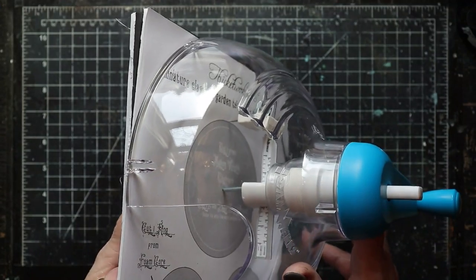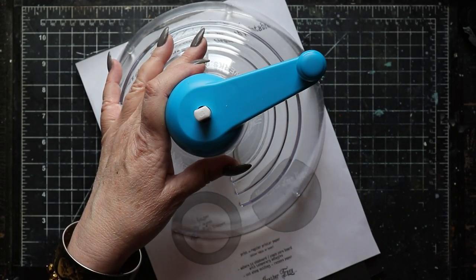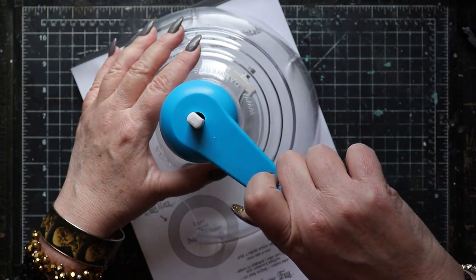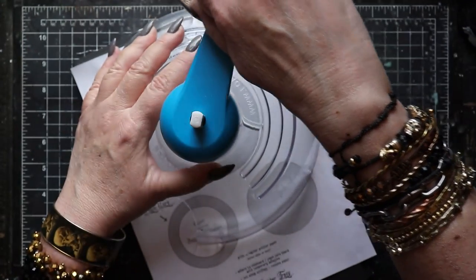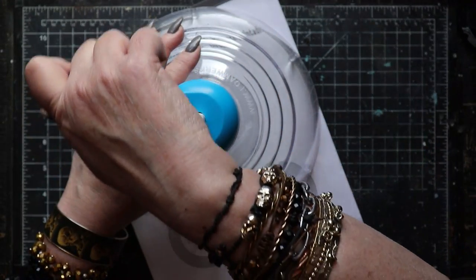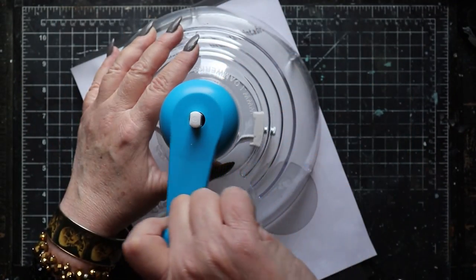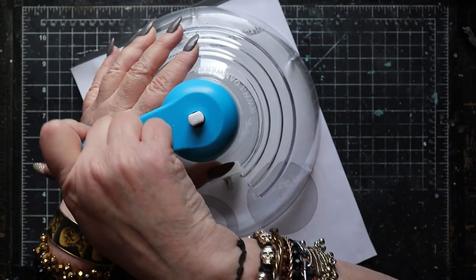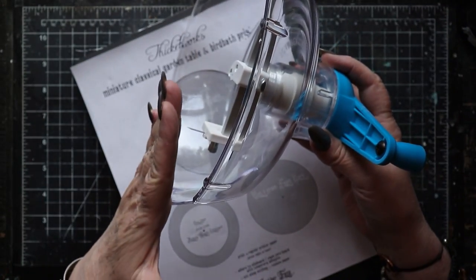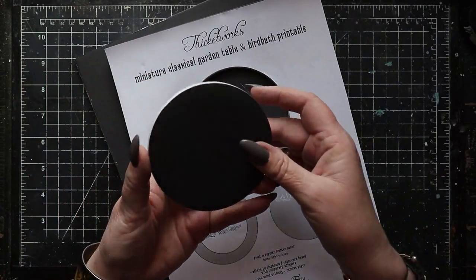I center that post on the dot in the middle of the circle. Now I hold the tool firmly and carefully wind it clockwise. The blade is being dragged around the material and is slowly descending with each turn of the handle. This is why it's so important to have a sacrificial board underneath the upper layer that you're cutting — otherwise you'll dull the blade almost immediately on your cutting surface. Once the cut is complete, it's important to wind counterclockwise until the blade retracts; otherwise it will hit the surface of whatever you put it down on, dull the blade, and might hurt the surface.